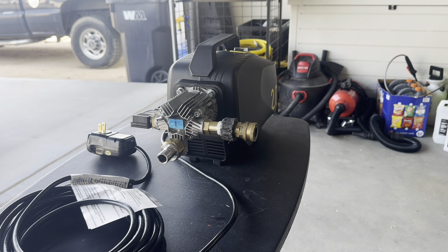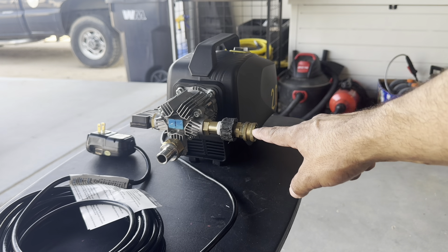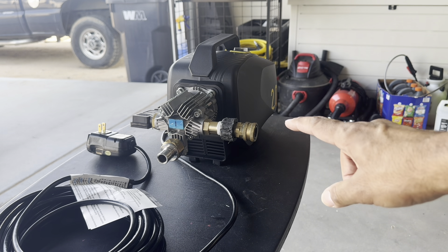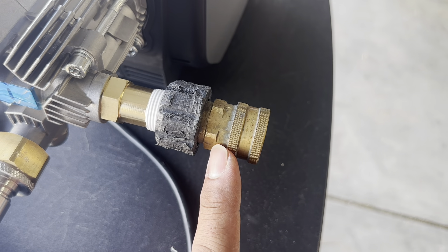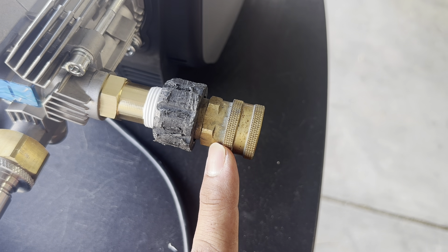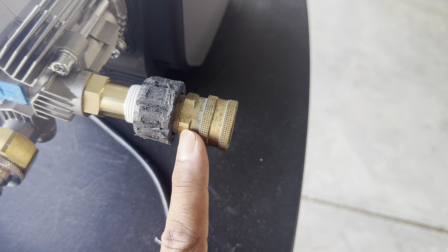The first things I did have nothing to do with functionality — it's all about ease of use. I tried to replace all of my fittings with stainless steel. I have stainless steel here, and I still need to order a new stainless steel fitting for this spot. There are also stainless steel fittings on my new pressure washer hose. If you have brass quick connects, you can see the brass fades and discolors over time — water leaves a coating that makes it difficult to plug and unplug the pressure washer hose. That's another reason to switch everything to stainless steel.